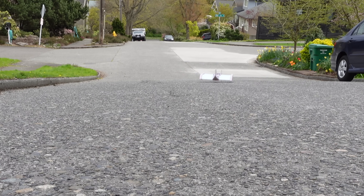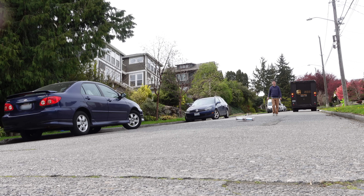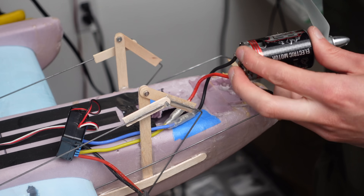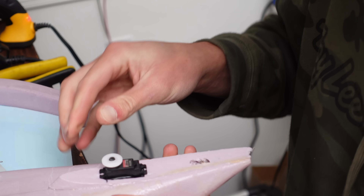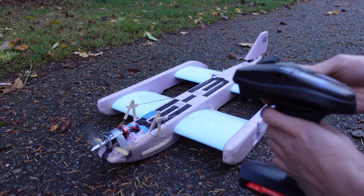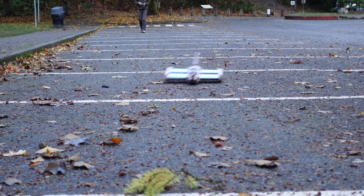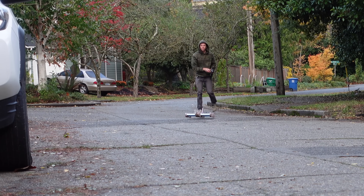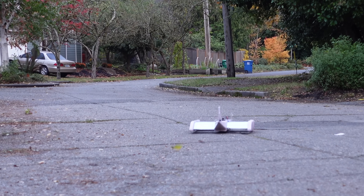The system seems too reactive — with too much airspeed it would go unstable and start to oscillate. Since this aircraft in theory should not need any external roll and pitch inputs, I added an RC car motor, ESC, and receiver, and glued the steering servo directly onto the rudder for steering control. All these electronics weigh a lot, and it was also just super nose heavy, so it was just skimming across the ground and not really flying. Then it exploded on my tire — but that airframe was kind of a piece of crap anyways.